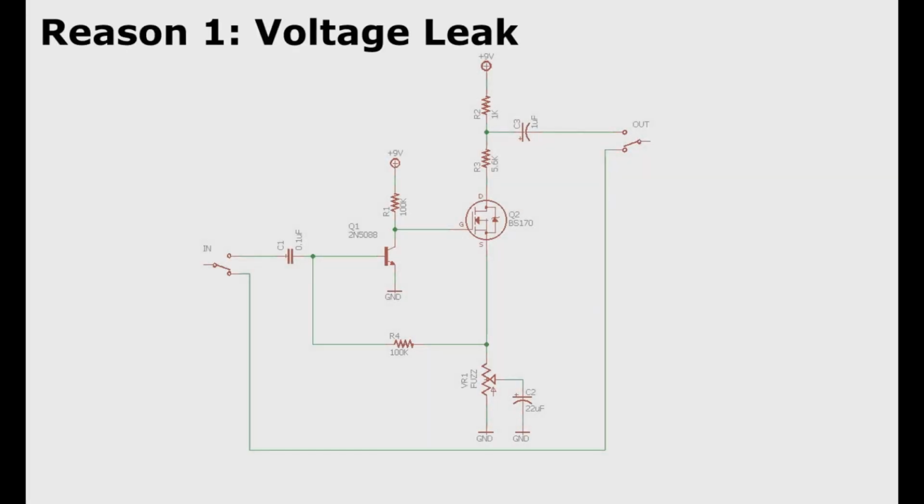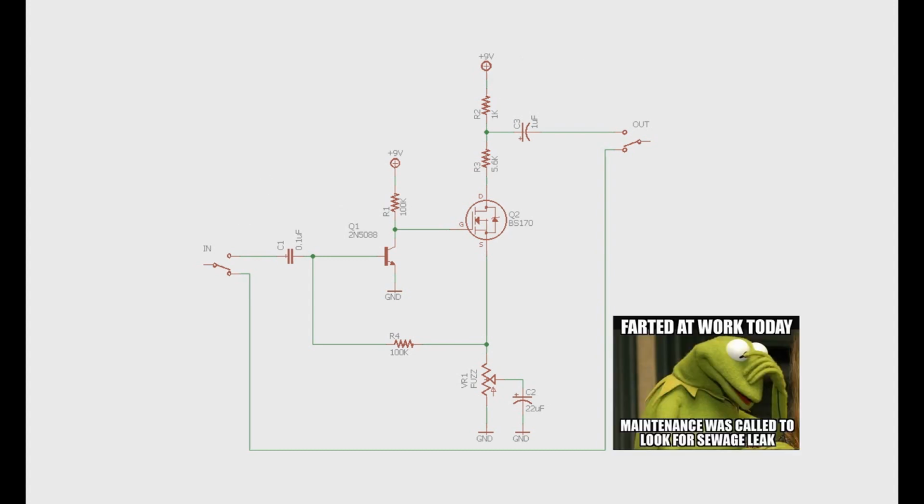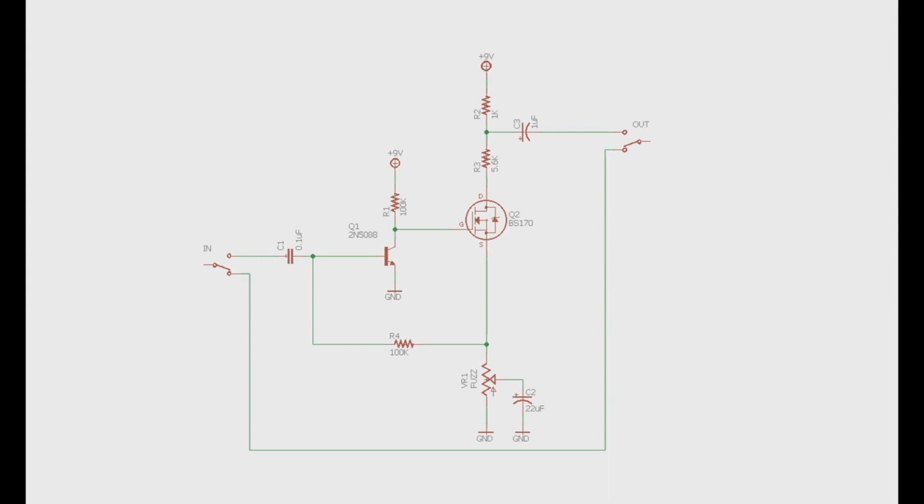Reason number 1, voltage leak. This is caused by the input and output of your pedal having a small built-up voltage. Typically on pedals, we have an input and output capacitor to decouple or block DC voltages from doing this. However, capacitors are not perfect and have a property called voltage leakage, where some of that DC voltage does make it through to the other side of the capacitor, giving us that small built-up voltage at the input and/or output